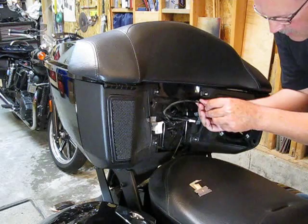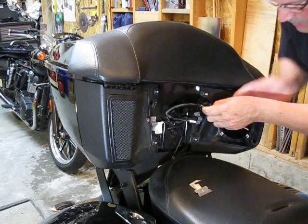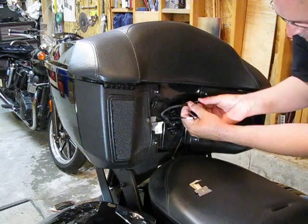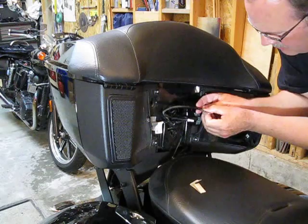I'm taking the pick and I'm going with the wiring — I'm not cutting against it. I'm poking through the sheath, and I am just taking a sixteenth of an inch at a time, and I'm ripping it just to make sure that I don't touch any wiring. You can see it's starting to open now, and I can even take my single-sided razor blade and very gently continue cutting through the sheath.